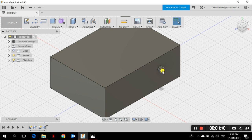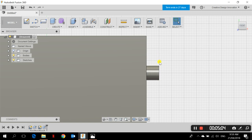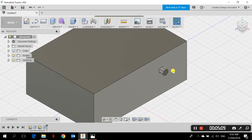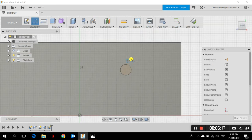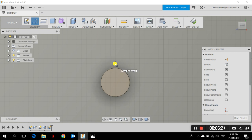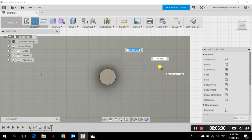Now I need to build the rocker into it. I choose this face because I'm going to draw the rocker sketch — which is about 5 millimeters from the body. The best way is to choose this particular face, then create a sketch line or press L. I start my point here. The rocker needs a shape almost like this, so I go for around 15 millimeters for the first segment, then click.